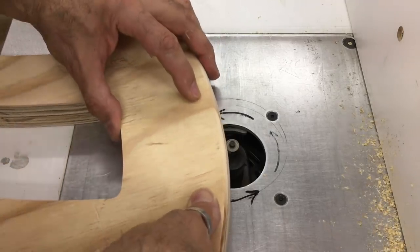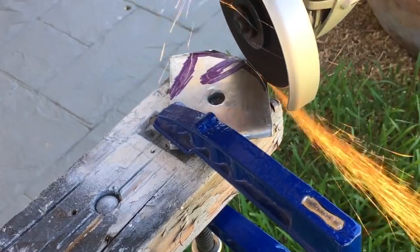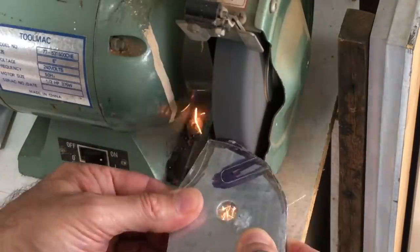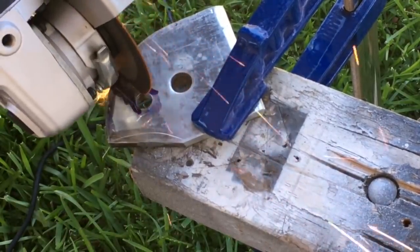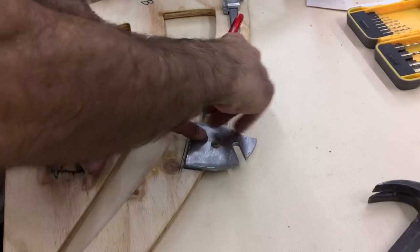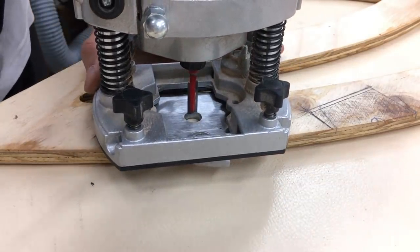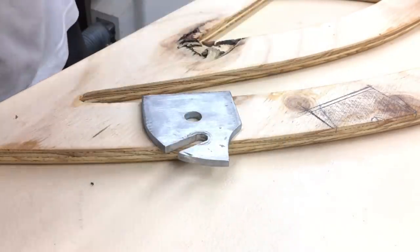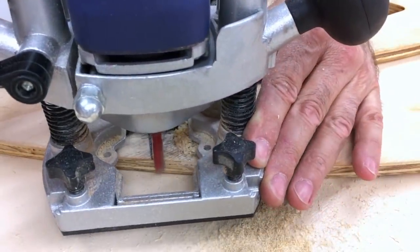Next I had to make the steel mounts for the rear wheel. I hand-drew a few designs, settling on this one. I cut out the mounting brackets from five millimetre steel brackets I bought from the hardware store. The axle brackets needed to be inset into one of the halves of each side so that the two layers forming each side could be laminated together. I set the depth of the router bit straight from the bracket and cut the insets by hand. I tack welded the two brackets together and then finished shaping them as one and drilled the mounting holes in both because they needed to be identical to each other to eliminate any alignment issues with the back wheel.